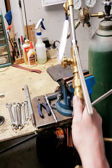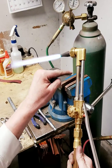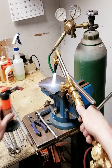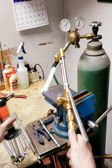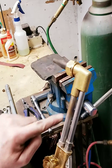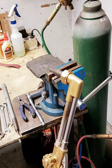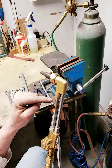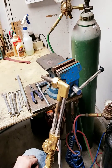When you put the fire out, it's going to burn back in. When it burns back in, you can hear it burning. That noise there — it's burning back in and getting really hot right here really fast. There's an O-ring on the mixer that I'll show you in just a second. That O-ring is either trashed or almost trashed. If it gets as hot as this one has been, there's a chance that the mixer is completely melted out of it.